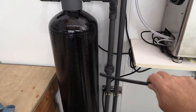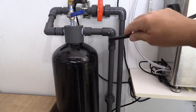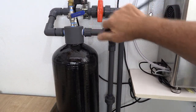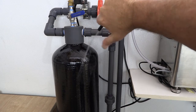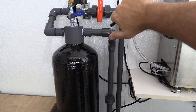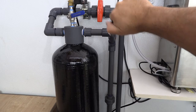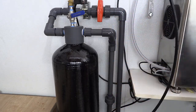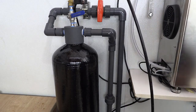You want to adjust your ball valve to where you have just a little bit of pressure drop here. Hold your finger over it for a few minutes and what you should see is it spurts like that — that's about right where you want to set it. You're building head pressure up in there but not too much. Keep adjusting that ball valve until you get that kind of action going, then hook it up to your drain and you should be good to go.